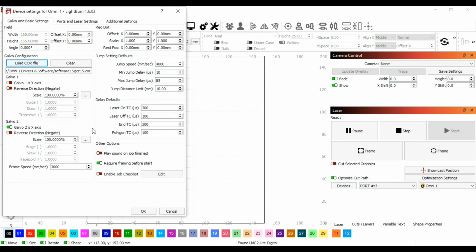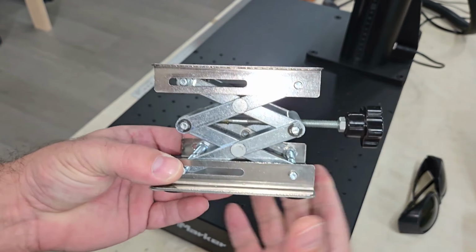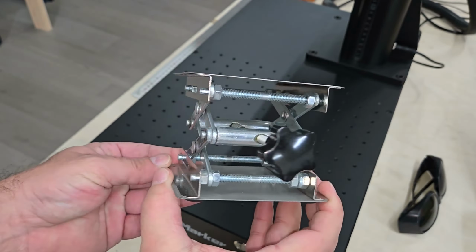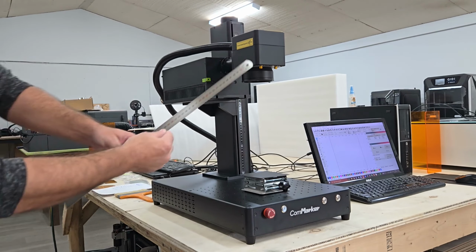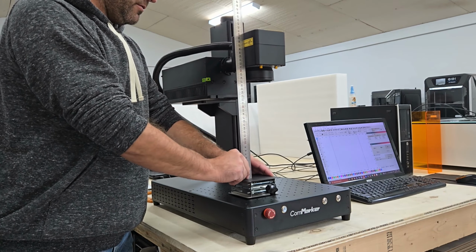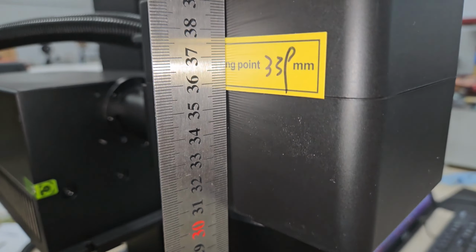The first thing that I wanted to do after connecting to Lightburn was calibrate the lens. I've never had an issue with bulging or skewing when engraving with Galvo lasers like this, but I have had a few that didn't engrave at the right scale, so to check that, I first set up a piece of black construction paper on the provided lift and set the focal distance from the top of the work surface to the middle of the joint in the laser head enclosure. In my case, that would be 339mm for the 150mm lens and 204mm for the 70mm lens.